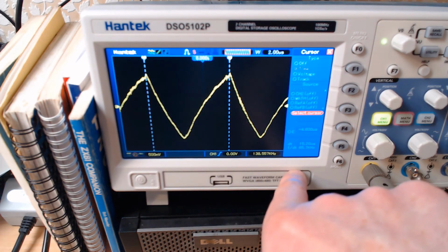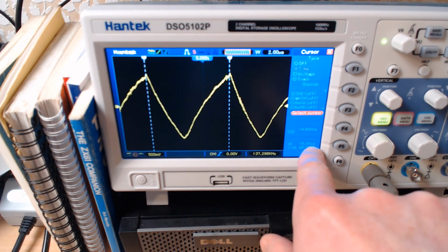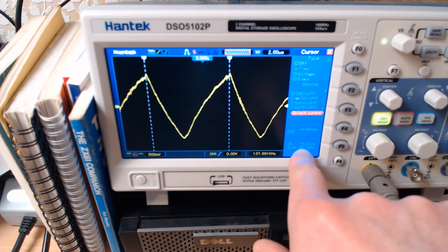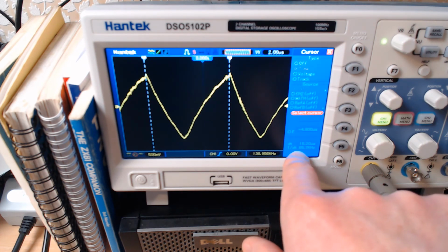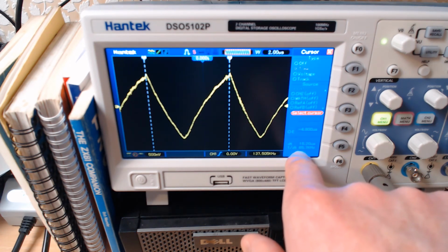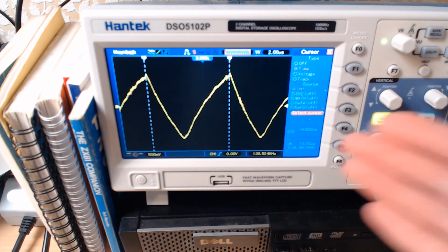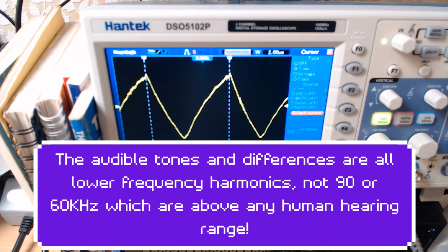Okay, so we've got a measurement there. I hope you can see that dt is now 15.2 microseconds. It was 1.78, I believe. I'll have to check the video again. I'll probably put a caption up. And 1 over dt, the actual frequency, is 65.7 kilohertz. So you can audibly, and by measuring it on the scope visually, see that we've actually de-optimized the code.